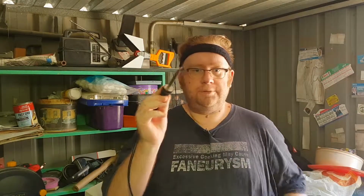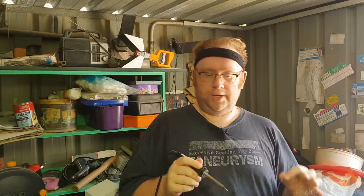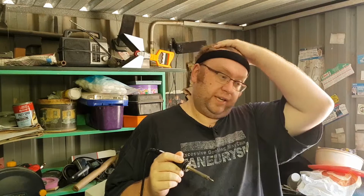So the last tip when it comes to soldering iron is you've got to be careful when you're soldering a component. Components, for the most part, are built to withstand heat, but just not a tremendous amount of it over a long period of time. You essentially are looking at doing this roughly 2 to 3 seconds. So let's do the extremely slow version.